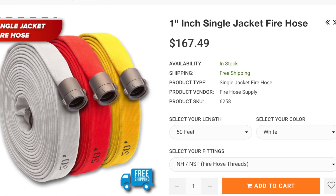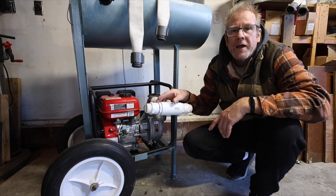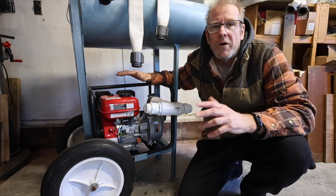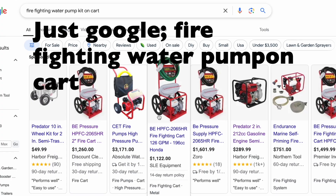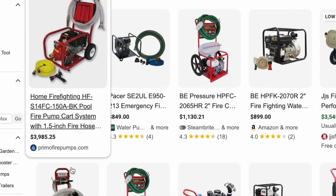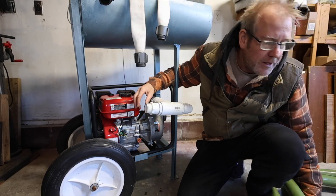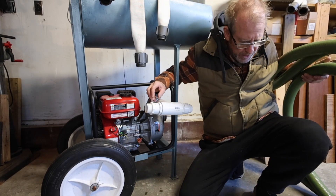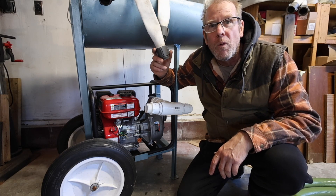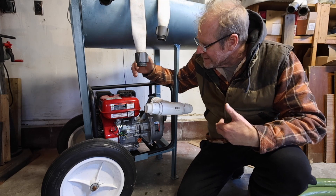One inch is a real fire hose size and there are some benefits to it. Also, these pumps are not designed for fire use at all — they're just pumps. So consider some of these other pumps that are designed and advertised for fire use. They come with a cart, an intake line, and one hose, and then you can add T's — which I think is really a critical quality to making this thing very effective. Consider these options before you just get what I have.